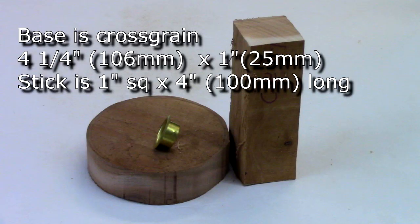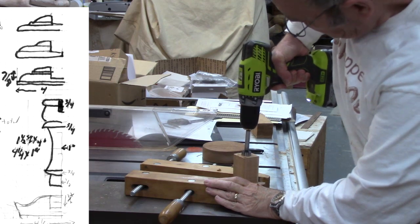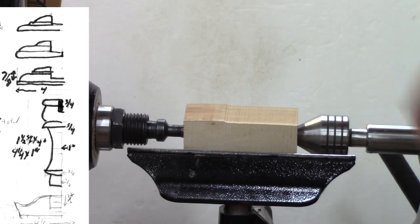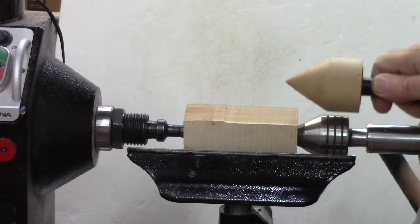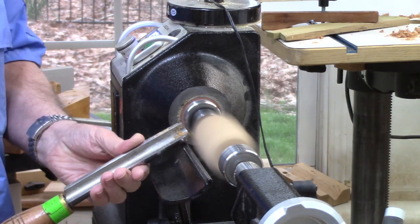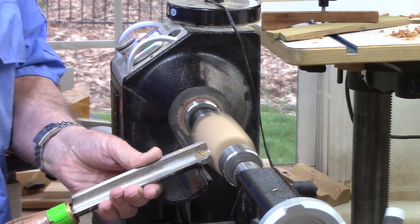In this smaller candlestick I'm using cherry, shown here with a metal insert. You can drill this with a hand drill but I find it easier on end grain to deal with that with a drill press. In terms of a cone, once you drill the hole you can either use a 60-degree cone or you can actually make one for your original manufacturer live center, and that works well. The first thing you do is rough it out.